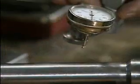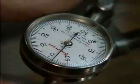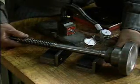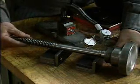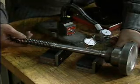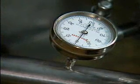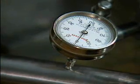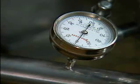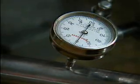test. He puts the dial indicator in contact with the stem, zeroes the dial indicator, and then rotates the stem. The stem is straight if the pointer on the dial remains constant on 0 during the entire rotation. Deviation on the dial indicates that the stem is bent and that it may need to be replaced. Check with the supervisor for the amount of acceptable deviation at your facility before you replace a bent stem.